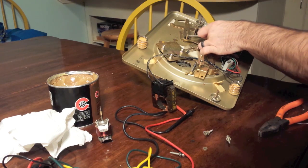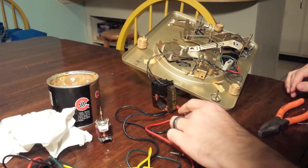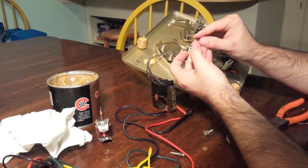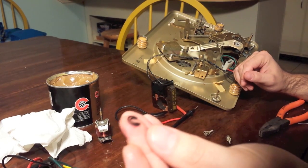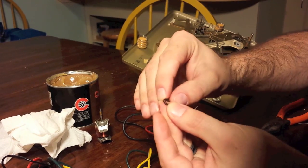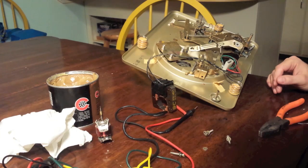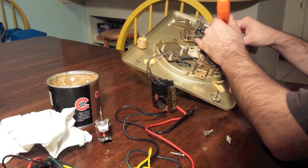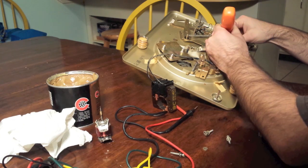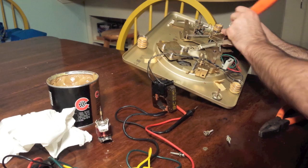Then start disassembling, and be very careful with these snap rings like this one here that is holding the whole rig together. It's pretty delicate — it has this clip with a hole in it that can be bent very easily, and the snap ring will have to be replaced at that point. So we're going to take a screwdriver and very gently pry these off, keeping my finger behind it so they don't go pinging off into the netherworld. Just pry these linkage C-clips off.